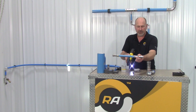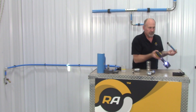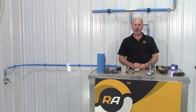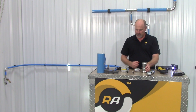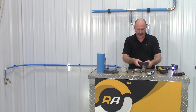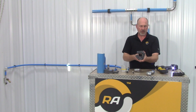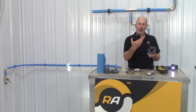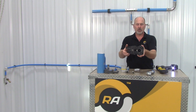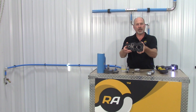You can hear the tool stops when the connection is made. There's a little release button that will release the pressure. Open the jaws, and you have a pressed-on fitting onto your pipe. Permanent seal, lifetime warranty. For inch and a half diameter and larger diameters, we need two sets of tools for the installation. First, we're going to have a wraparound jaw that goes around the fitting, and then we have what we call our scissors that engages like this. The tool will press the same way as the smaller sizes.